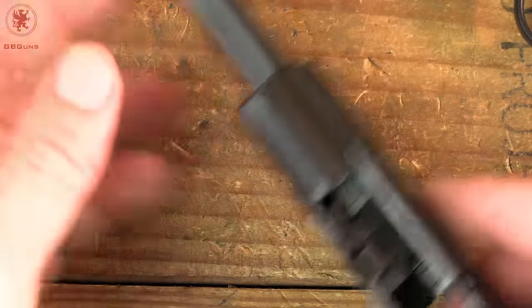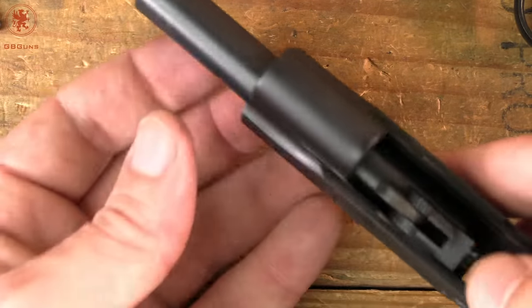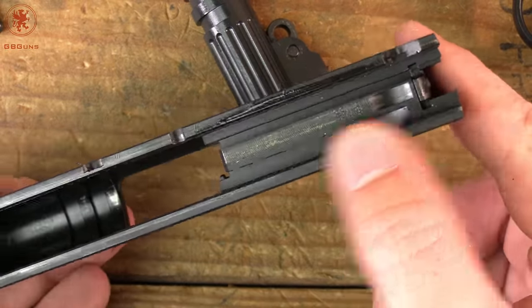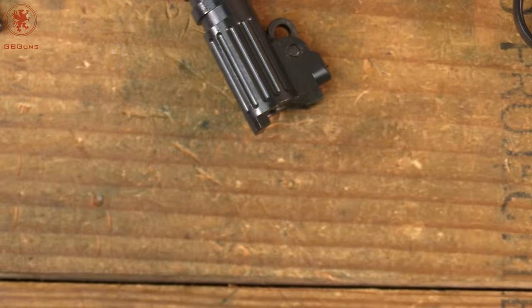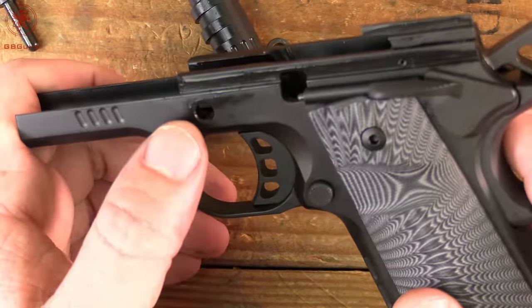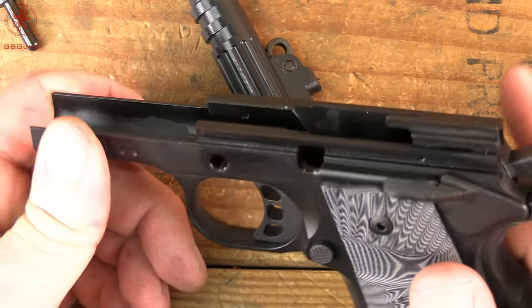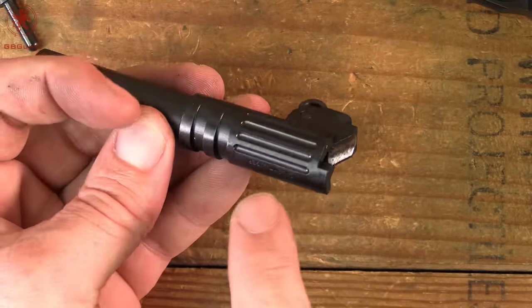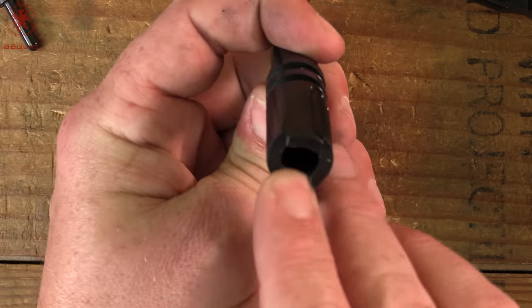There's our nice short guide rod and our barrel. Once the bushing is turned right it comes straight out, and the barrel can be pulled out the front. Looking inside the slide, it's definitely a 70-series — there's no extra stuff in there; your manual safety is your safety. I did notice the action felt a little coarse — not super slick like on a real high-end custom gun. It might need some break-in or just a little more oil. There is some oil on the rails already but it's starting a little tight, which in the old school days is how you wanted a 1911 to start so that as it breaks in things loosen up. And here's our four and a quarter inch barrel with those nice lightning cuts inside and a long feed ramp that is polished.